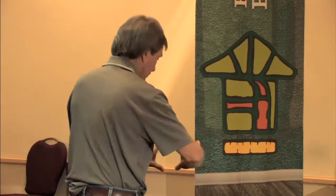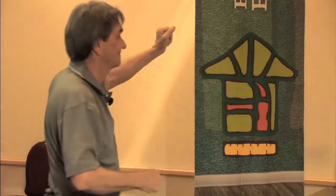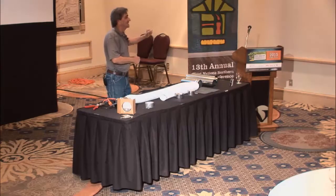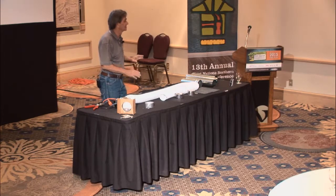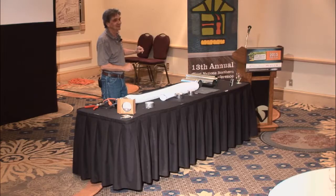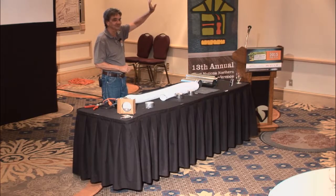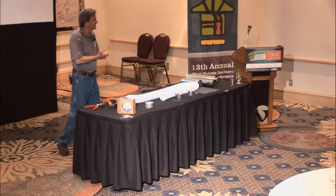And then the other thing that Grandpa had to do was leave the stairway open because that cold air came down the stairway to go back. And so the stairway was the down path and that hole was the up path. In our more modern systems, we usually had the hot air or the cold air return flat on the floor. And it was basically because cold air would just spill in. There would be a little bit of a suction, but mostly the cold air would spill in and go away.